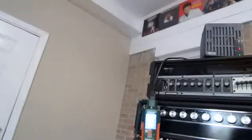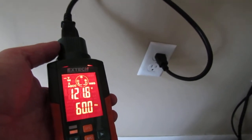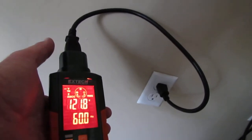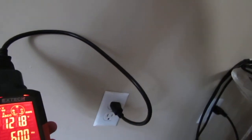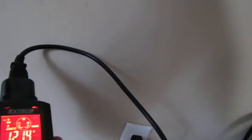I'm going to unplug this and show you what I'm talking about — embarrassing as it is, I actually have one myself that I haven't gotten around to fixing. This outlet has a reverse hot/neutral wiring. If you've got a refrigerator plugged into something like this, it can potentially affect it. You'd be surprised how many houses I've inspected where many outlets are just not wired correctly. It will still work, of course, but it's not right and it can actually damage the appliance.